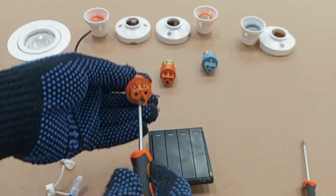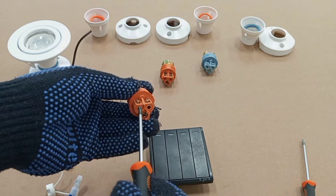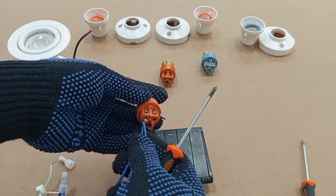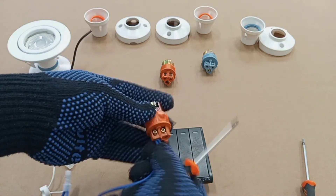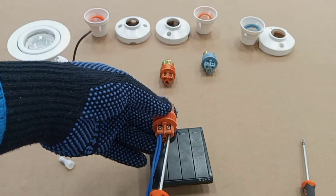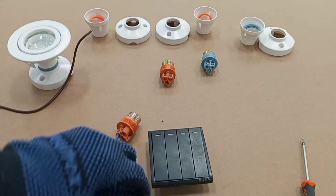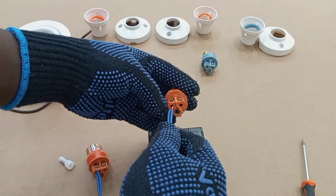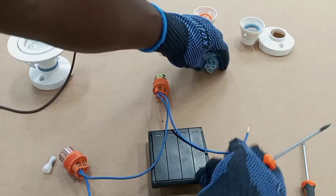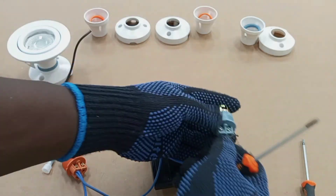This terminal is for earth or ground, but in this demonstration I am using only two terminals for live and neutral. Our first neutral loop comes to one of the two terminals I'm using, and live will come to the other terminal. The next neutral loop goes to the next lamp holder, and the final neutral connection goes to the last lamp holder.